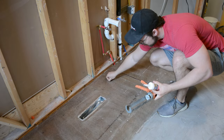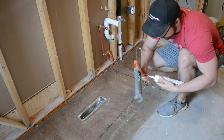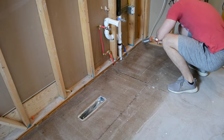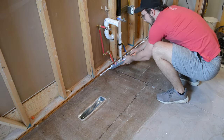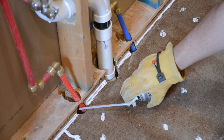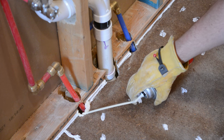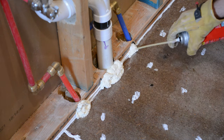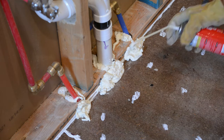When using silicone it can get messy, but in this case you don't need to tape your lines because it'll all get covered up with concrete. You do want to tape the seam where the floor meets the base plate of the walls so no concrete can seep out of those joints. I then came back with spray foam to fill some larger voids too big for silicone, and I also filled nail holes in my subfloor with silicone — those are the white dots on screen. Basically, fill all the voids you possibly can so the cement has nowhere to leak out.